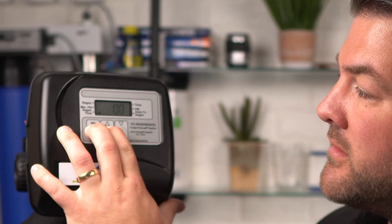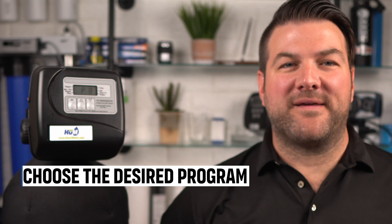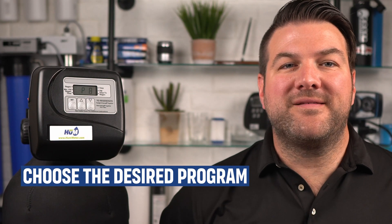From the service mode, press the set hour and the up button simultaneously for three seconds and then release. You'll need to do this twice. Choose the desired program by pressing the up and down buttons. Prior to selecting the program, verify that the application is for a backwashable filter and not a water softener. Again, the settings will be P7 to P9.